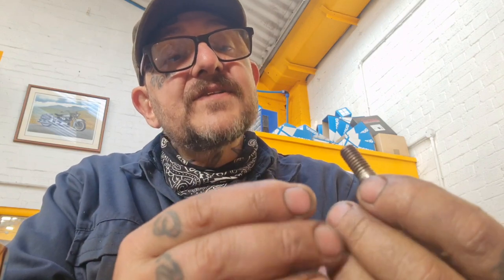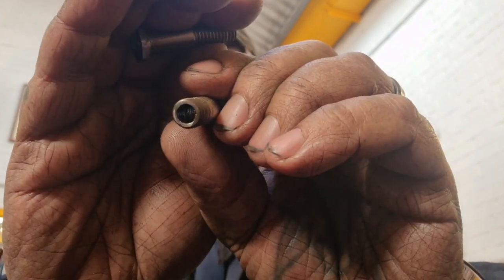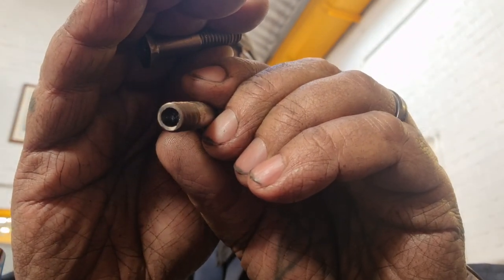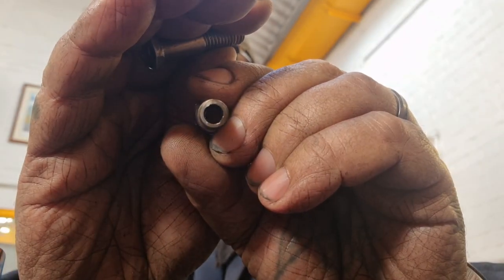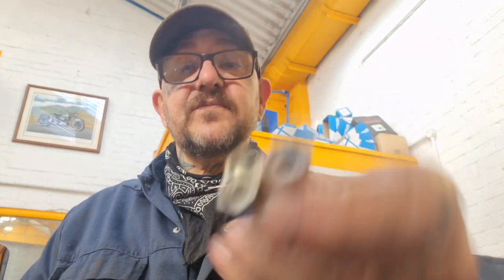And A2 stainless, I learnt. You see, the end of that's a bit ragged there. It's not the cleanest end in the world. Is that one's nicer? The hole I'm on about is because it burnt the drill bit. It glowed. It got that hot. I wasn't going fast or hard or anything. And when A2 stainless gets red, cherry red, it goes hard. So it's hard to machine, which proved difficult cleaning these up, but I didn't knacker any cutters.